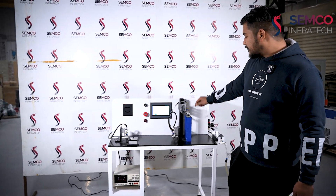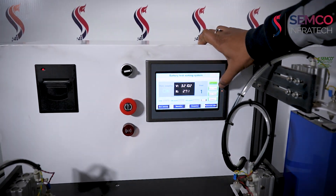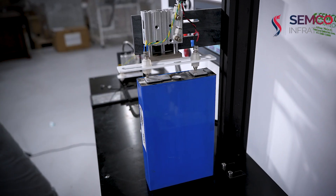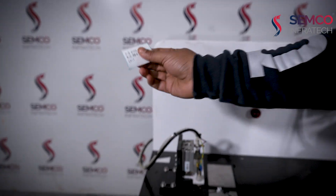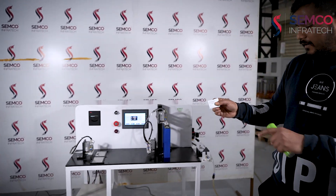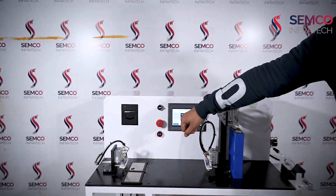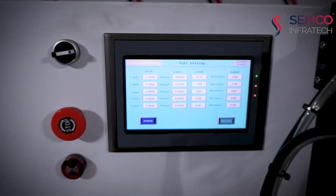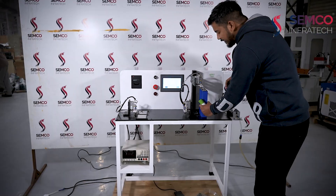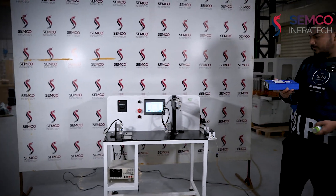Now we're going to check the IR as well as voltage of this prismatic cell. We will click return, then change the mode from cylindrical to square. After selecting square, we press the pedal again. You can see there is again a slip — the voltage is 3.2102V and the internal resistance is 0.89 mΩ. It will again come under level one, as we can see in the sort settings. So for this cell also, it is placed in the LV1 category.